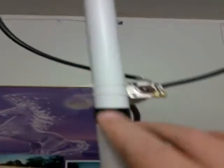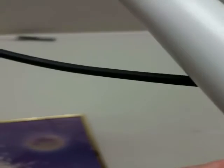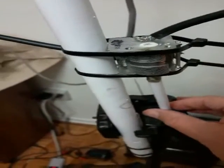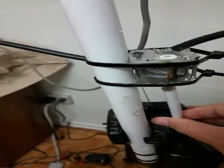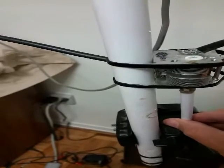I wasn't getting very good results, so what I did was I took this connector here and pulled it down, which made my primary a little longer. As you can see, the length and the placement of the primary loop does affect the SWR. I've repositioned my condenser. You get it so that the noise level is the loudest, and then we key down.